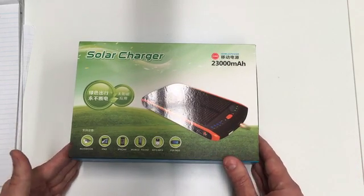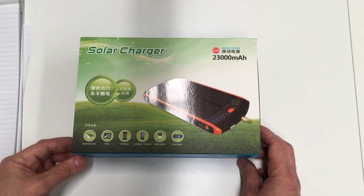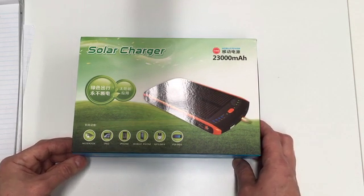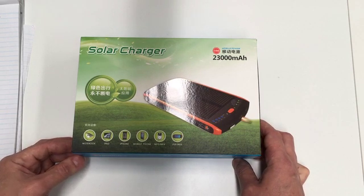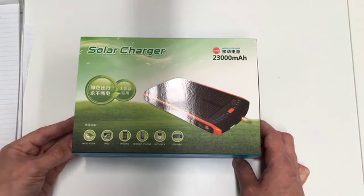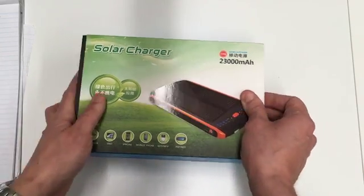The biggest problem people face when trying to find portable power for laptops is the output. Most laptops, so your Dells, your Lenovos, they're not going to charge from 5-volt USB. Most power banks will have 5-volt USB coming out of them, and it's not high enough. A lot of these laptops nowadays need a 19-volt output. This particular power bank will cross over. It will do all your smaller stuff.